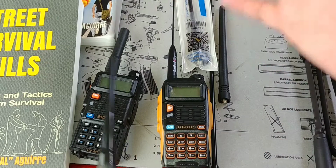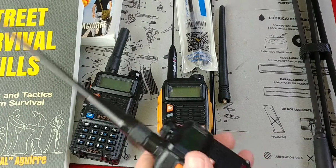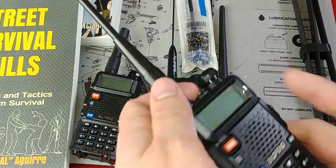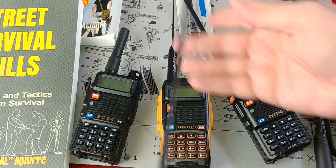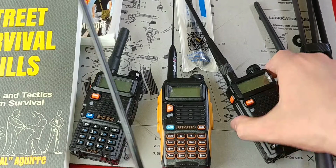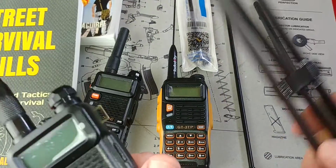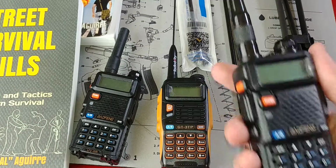So it's portable enough, and it's a slight improvement. Maybe you're going to be getting more of a solid connection at those 2 miles out in the open. City is going to be a problem. Anytime you have walls and interference, anything that complicates the communication, it's going to bring that range down. This would be as large as I would go for a fixed antenna that is not likely to be breaking the terminal. This is something you could have in a backpack and deploy when you need it, but if you get to that point, you may want to go with these wire antennas that you can hang on a tree with a line. That makes maybe more sense.